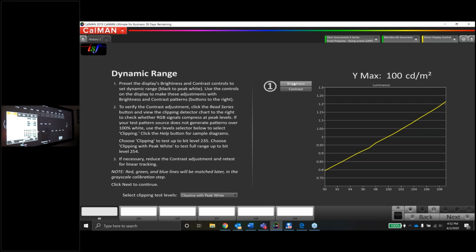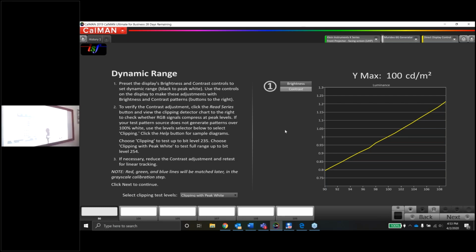Now, the good part is here, guys, what I'm noticing just with my eyes, as I turn the brightness up to see number 17, the background did not get gray. The background actually stayed pretty black, so that's good. A lot of times on a lot of flat panels especially, and even some projectors, when you turn the black level up to see that 17 box, the background gets lighter as well. So in case of like an OLED, if you turn the brightness up too high, you've ruined the black levels of the TV, and that was kind of the whole point. But in this case, this was actually pretty cool. I was able to bring the brightness up 6 clicks without making the background dark gray or light gray, and now I can see 17 no problem. That's an easy one. Let's move over to the contrast.